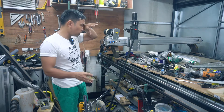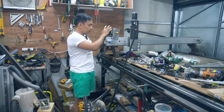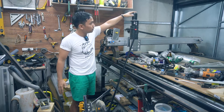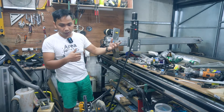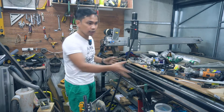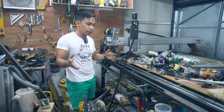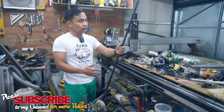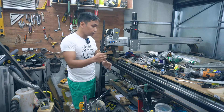The only missing parts for this whole build is the installation of the rack and pinion. I already have the motor here — this one on one side, and then this one is for the x-axis. The y-axis is out here, and the z-axis is at the top. The x-axis is driven by a closed-loop belt linear actuator. For the y-axis, which is 2.7 meters, I previously tried to use a chain but that failed — I have a separate video for that. I finally got the rack for this build.